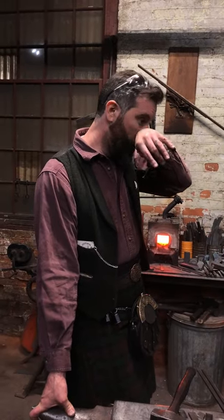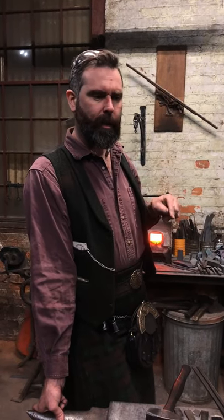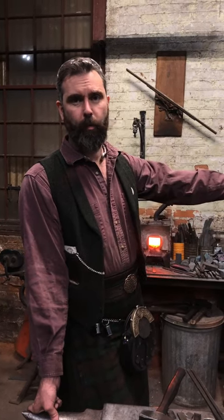Likewise, if you are plate quenching, so you're using a steel that you're quenching as an air hardening steel between plates. Think about it. If your plate isn't clean, you're not getting good contact. If your plate is not the same temperature as it was last time, so say you've quenched blade number 7, the first one, the plate was relatively cool. The last one, the plate was relatively warm. That's gonna change a little bit how much hardness you're achieving.